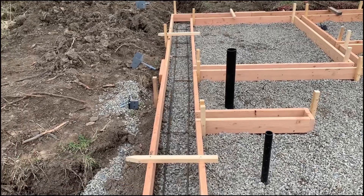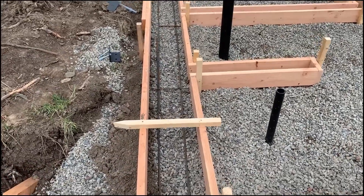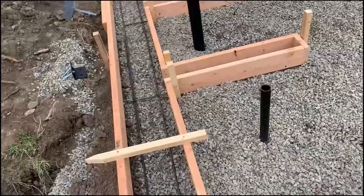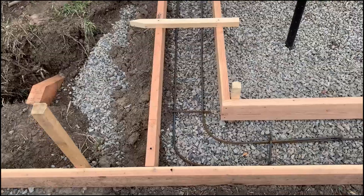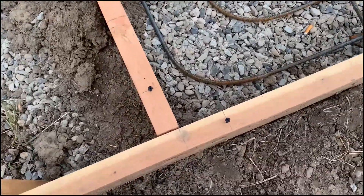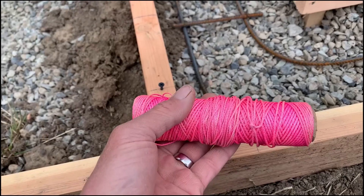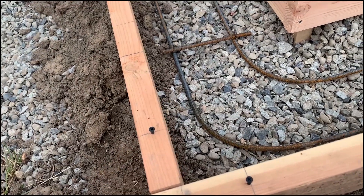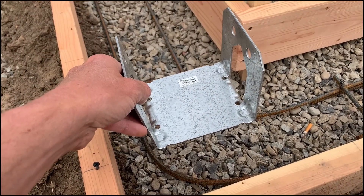The areas between the walls will backfill with some excavated subsoil and more gravel to get up to the height where we'll start working the floor. I've used these two-by-sixes to describe the perimeter. The outside will be about a seven to eight inch thick, one foot wide bond beam. A bond beam is a concrete pour reinforced with rebar — as I'm pouring, I'll lift the rebar into the concrete and it will provide the tensile strength that concrete lacks. At every post anchor location I have put some drywall screws, and survey twine to define where the anchors will go.